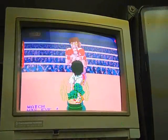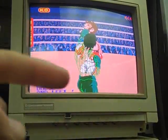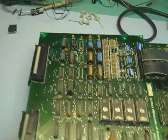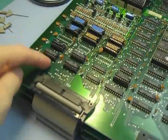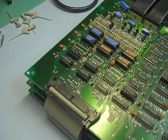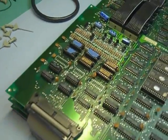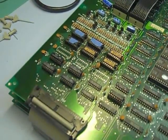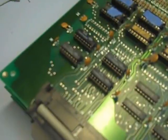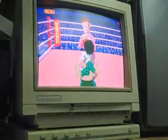There we go, much better! Looking at the schematics, there's a section of logic marked CHL — I'm assuming that's for the challenger — and then CMP for the champion. That's all it was: swapping those ROMs out with an inverted set. You can see I used sockets when replacing these data muxes to the PROMs. So if you're getting into Punch Out repair — or maybe looking to swap a Punch Out for a Super Punch Out — you may want to put sockets here. That way if you end up with an inverted set, rather than reprogramming all the graphic PROMs you can just swap the 153s for 353s and that should take care of it. This one will be going out soon.